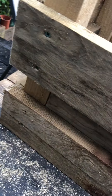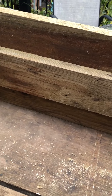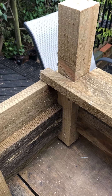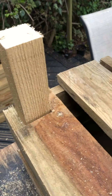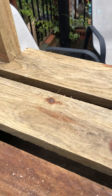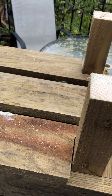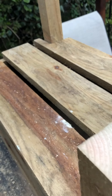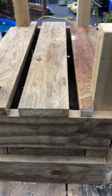These pieces are just stapled through with a nail gun - basically just a little bit of rebate on there. Obviously legs screwed in. I've just jigsawed these so they basically fit like that, and then that last piece goes in there. You've got a slot here - it's fine, there's a bit of drainage. I normally put a plastic bag - like a compost bag - to line this, and that keeps the mud and dirt in there. Basically just going to screw them in.